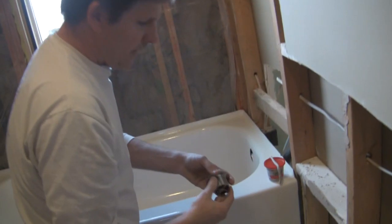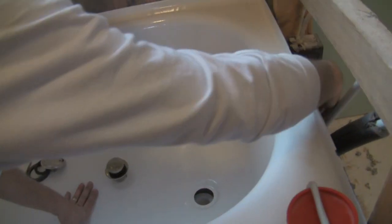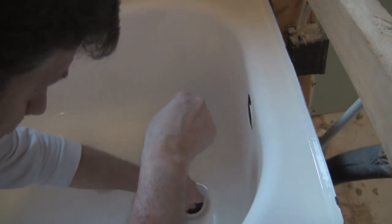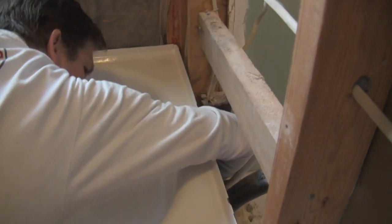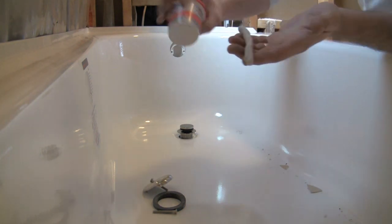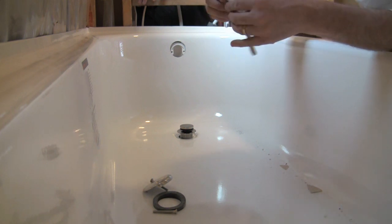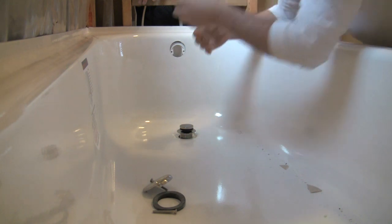We have this as our drain and our stopper. We've got to screw this into the new drain plumbing that we just installed. First, I want to put this rubber gasket on top of the pipe so that it seats up against the bottom of the tub. For the top of the tub, this plumber's putty comes in a container — it's just like Play-Doh, real soft and moldable. It stays soft even after we squish it. You can either use silicone around the drain or plumber's putty; we're going to use plumber's putty.